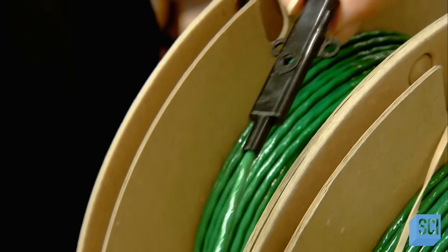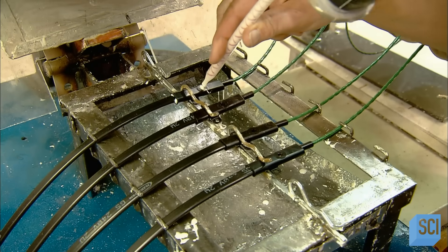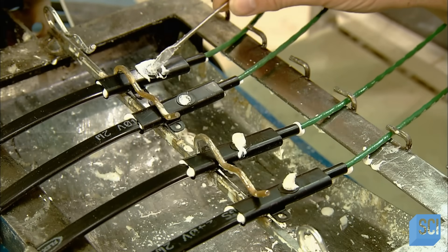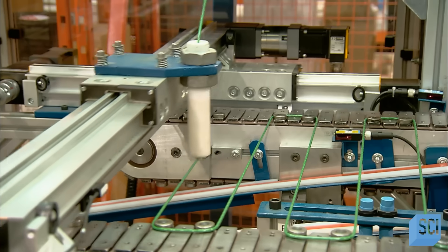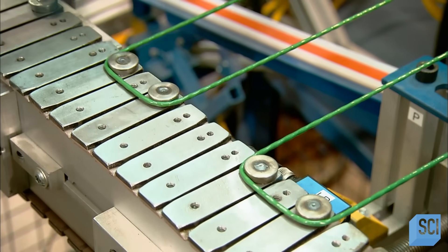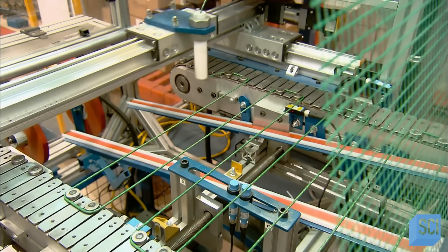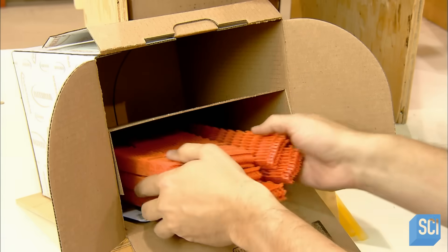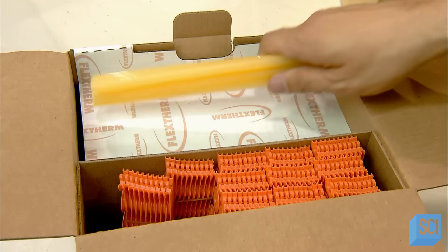This too must be sealed to prevent any water infiltration. After all, heating cables are often installed under floors in wet environments such as bathrooms. So they seal the joint by injecting enough polyurethane to fill every nook and cranny. The polyurethane takes three to four minutes to dry, then another 24 hours to fully harden. This machine assembles the other format — the rollout mat with heating cable embedded. First, it winds cable the same way an installer would onto installation gauges, then secures it to an adhesive-backed fiberglass mesh. Three strips of adhesive tape above and below reinforce the bond. The mat format is sold by the roll, while the loose cable is packaged in a kit with installation gauges and glue sticks to adhere the gauges to the subfloor.